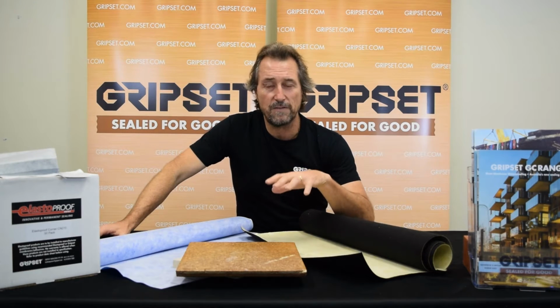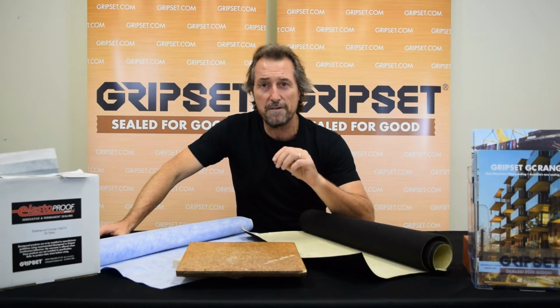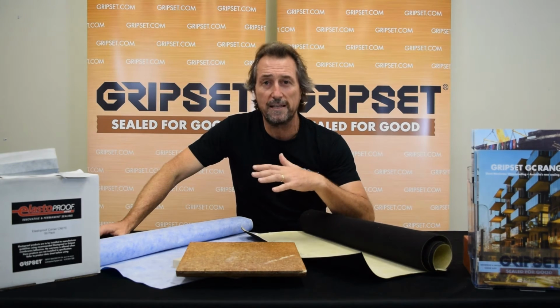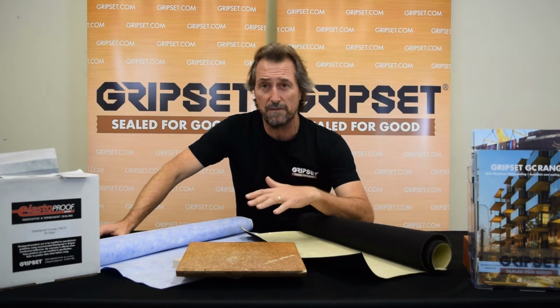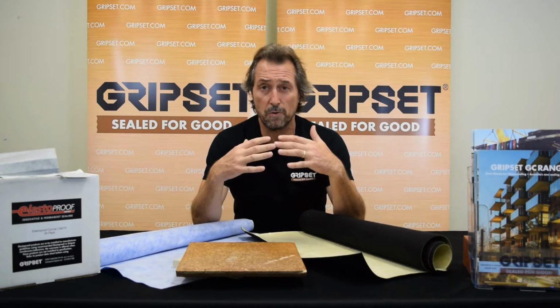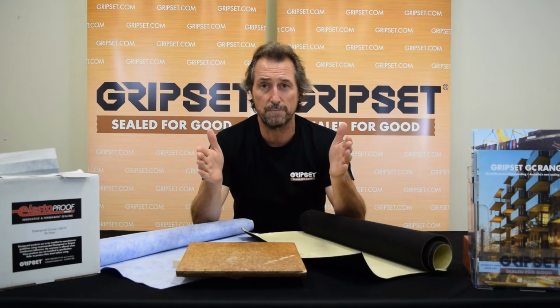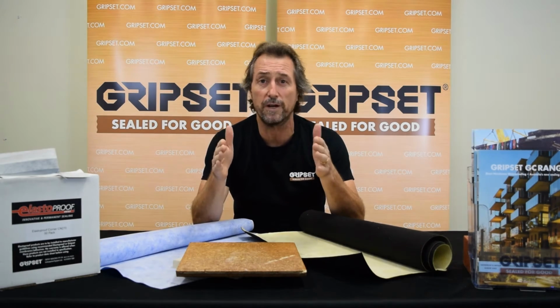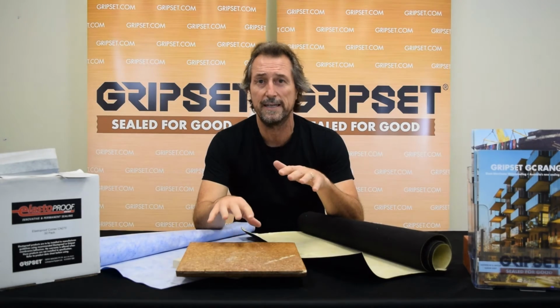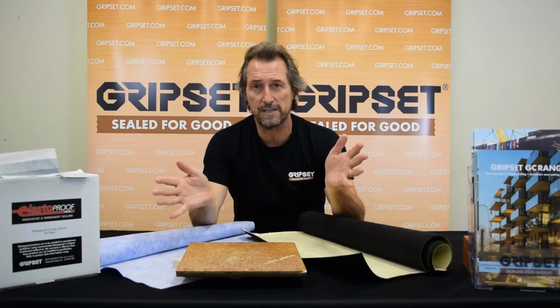Timber, for those of you who know it very well, is a living and breathing thing, almost like a bottle of wine. It's very important to understand that with timber, every time the temperature changes, you're going to have the timber move. Now, it's not visible to the eye, it doesn't move and flex to the point where you can see it, but small movement will happen in the substrate. So we have timber joists on building sites, but then we've got timber flooring. Now, particle board flooring is commonly used in dry areas, very stable for things like vinyl, etc., or carpets.